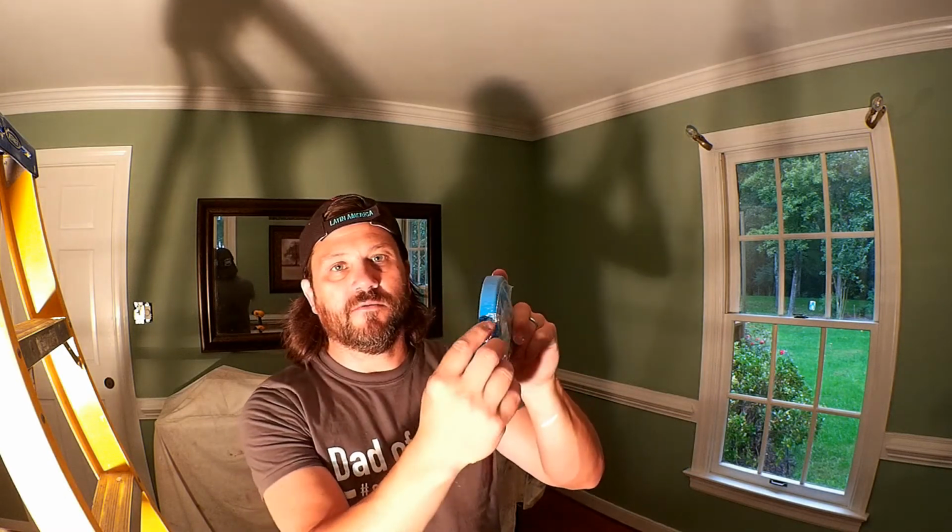I'm ready to put the ceiling junction box back into place. Because the joist goes right through the center of it, there isn't room to actually put a regular size junction box. It's just too thin or too shallow of a hole. But they do have these flat pancake style junction boxes, which are very thin and they just fit right in the thickness of the drywall.